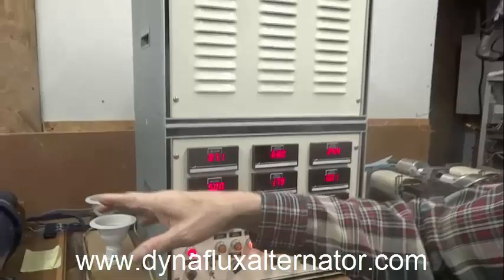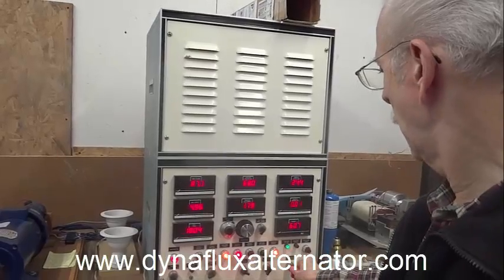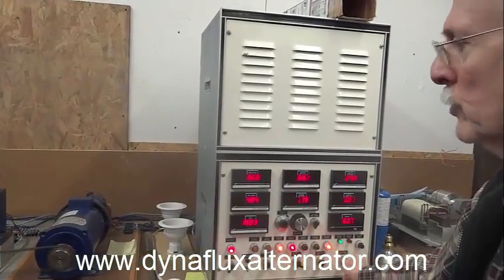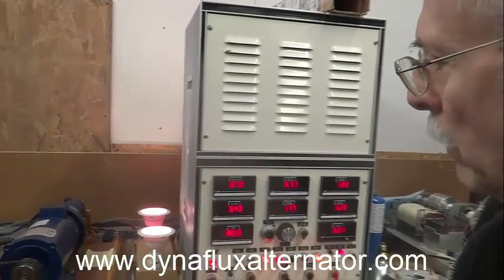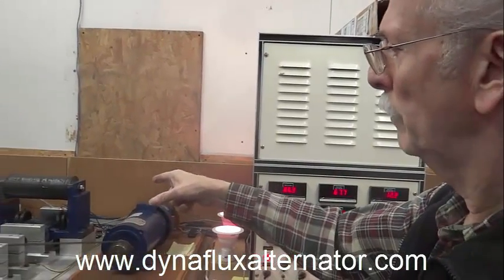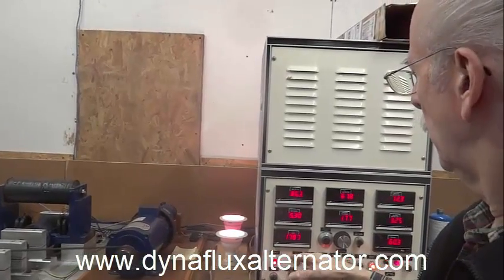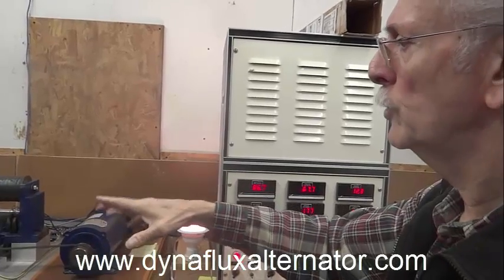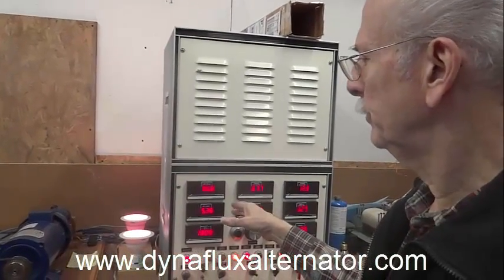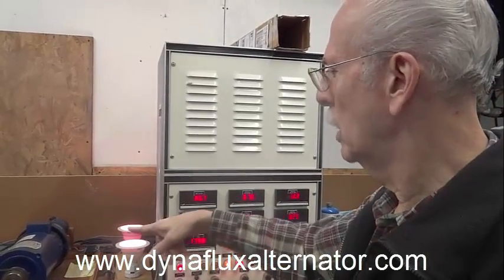And now we're actually generating the voltage. As you can see, there's 24 volts coming out of that machine. And when I turn this breaker on, the two floodlights over there will assume the electrical load. So those lamps are now being powered directly by the energy that is made available by the rotation of that machine. And if we had run the other machine first, we'd be able to contrast the behavior between the standard generator and this machine — then you'd see that this hardly presents a load of any sort whatsoever to the prime mover.